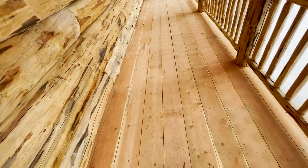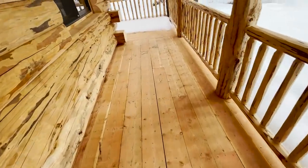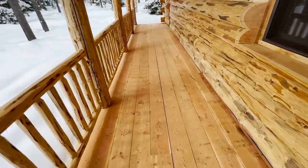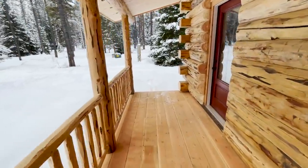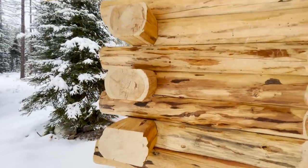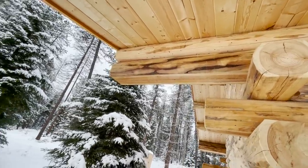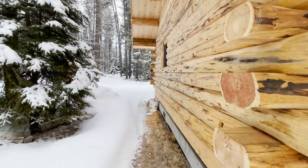This is our timber planking porch deck — we mill it at our yard, at our facility — and it makes a beautiful, strong, very robust floor. In the summertime we'll come back and give it three coats of exterior stain: the porch floor, the ceiling, the railing, the logs, all the exterior. These are big logs. Every home gets a four-foot overhang on the ends as a minimum to protect the home from the snow and the rain.